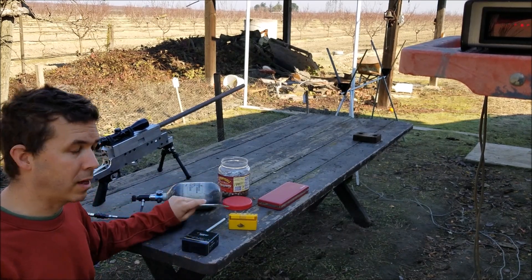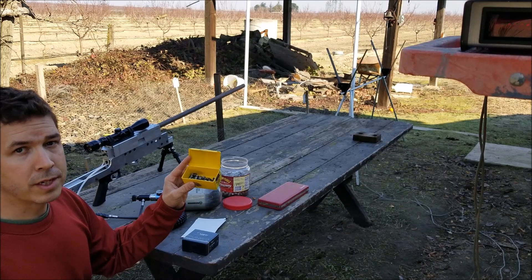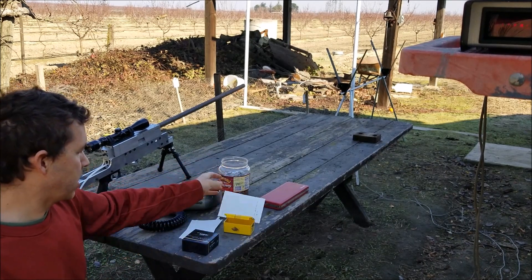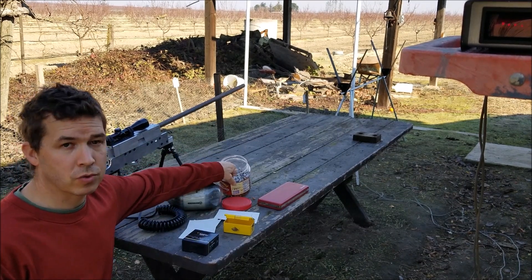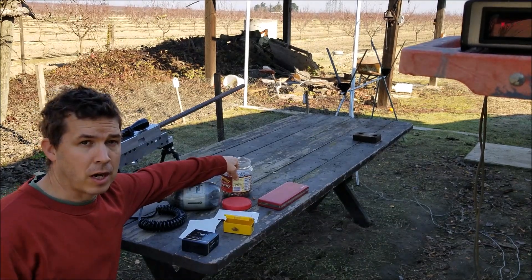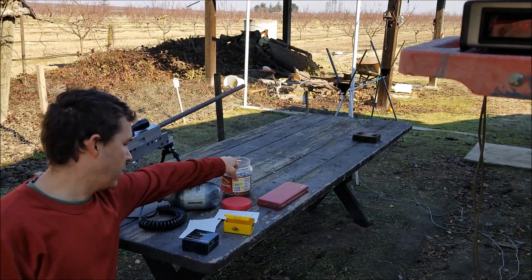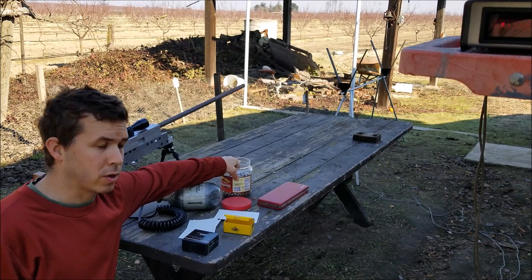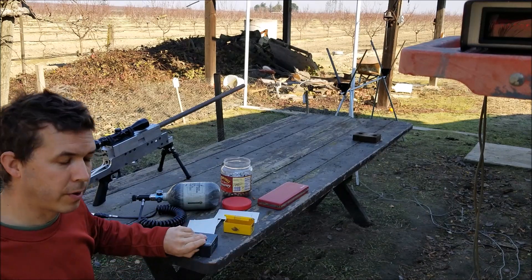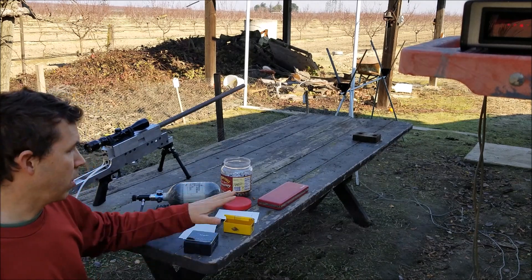I'm going to test three different bullets. The biggest ones are 196-grain lubed and sized .45 caliber, about .454 size, so they're really consistent. Then I've got some straight-from-the-cast at .453 — they vary between .453 and .451 because they're not sized, and they're about 186.5 to 186.7 grains. Then I've got .451 lead balls at 139 grains. I'll test all three for velocity.